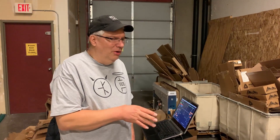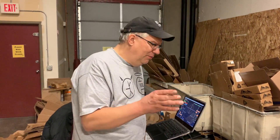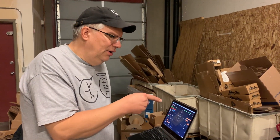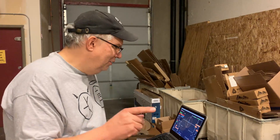We have our Crossfire Pro assembled and we're going to do our first real cut. We've cut aluminum and some steel, and now we have a design exported from Fusion 360 — a spur gear about three and a half inches in diameter. We don't have water in our water table yet, but we couldn't wait. We're using our Cut 45 with the power turned all the way down. We've been messing up this test gear a lot, so let's hope it gets through. Here we go.